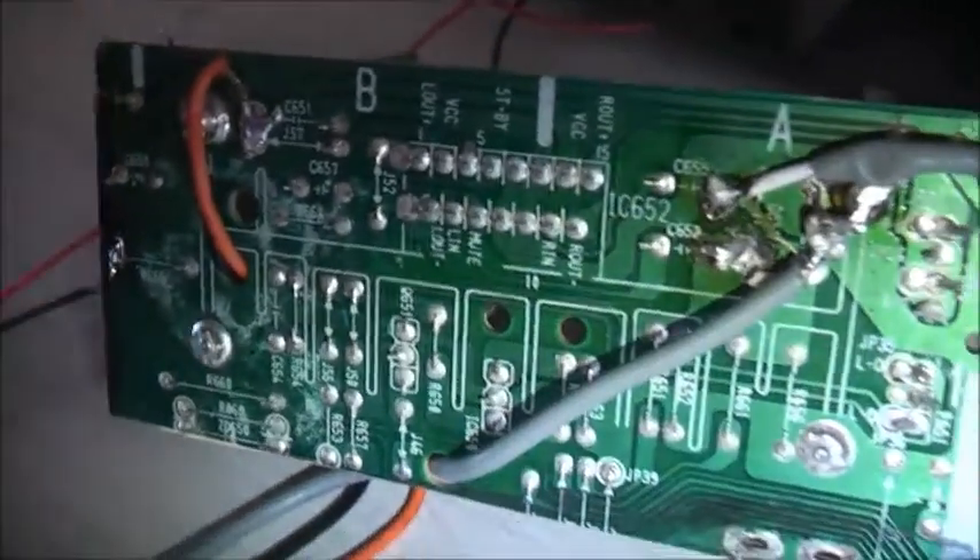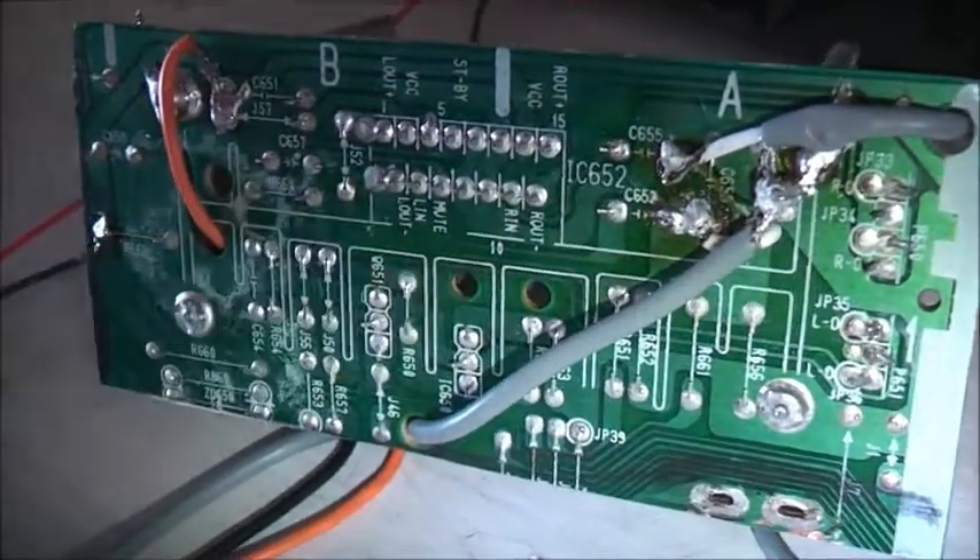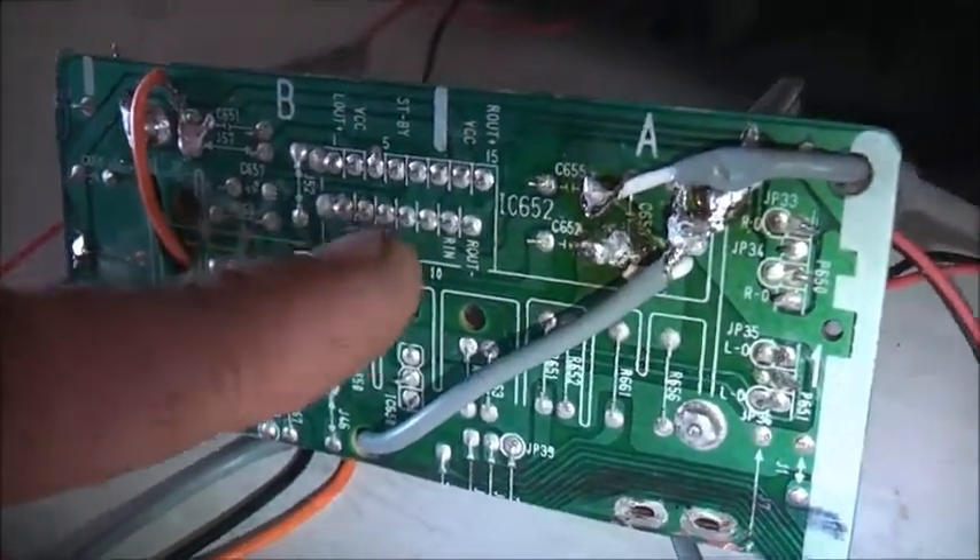I think you can put a 50 kilohm resistor, and it's in series with a switch — I think to the positive. That's how you trigger the mute function. I've wired it up all accordingly, the correct way.